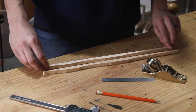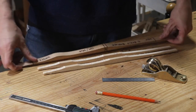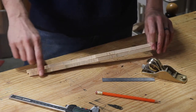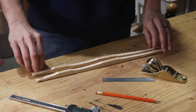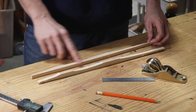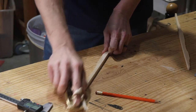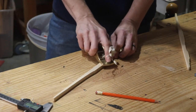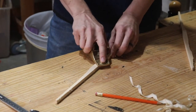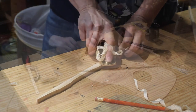Here are the two X braces. What I did was take some time to make a template of what the X braces will look like, trace that onto the wood, and pre-cut those lines out - so it's real rough on the X brace. Then I cut the X brace in half so I can see where I'm at. I know I need to take some material off, so now I can take the plane and plane down both sides.